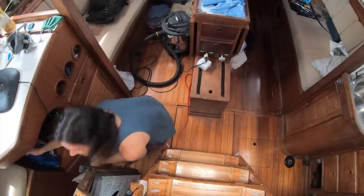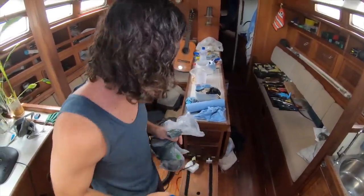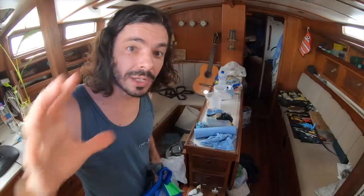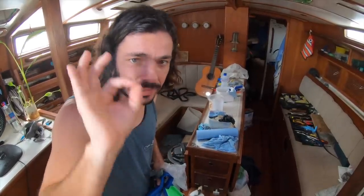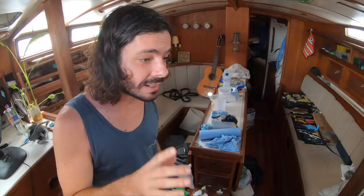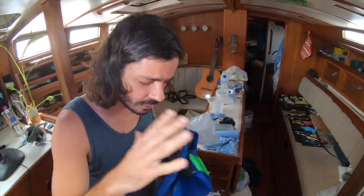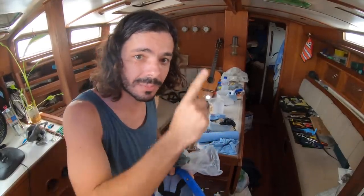The plan for today? The plan, of course, changed as always. We were supposed to paint the engine room today. We are going to do it later, but first we are going to go to the shop that we've been working at this week. I'm not sure if we showed you these images already, but we took all the pieces from the propeller shaft seal to Reginaldo's shop, our friend who has a sandblasting machine, and he sandblasts all the parts that are painted so they can be properly painted, because if you sandblast, then the paint is going to last for a long time. We sandblasted, he gave 2 coats of epoxy to protect, and now for the third coat, instead of painting it, we are going to assemble the system and then paint the third coat, because then we paint all the holes for the screws and protect everything. It's not stainless steel, it's carbon steel, so it's going to be safer. So now I'm just trying to organize all the pieces and bearings and retainers, because we're going to go to his shop and assemble this beast.